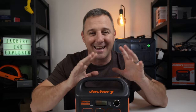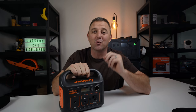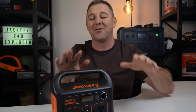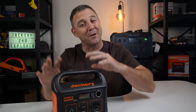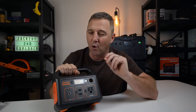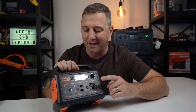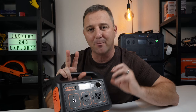Here are a few things I actually find useful. First, this power station is not too expensive — I've found it for around $200, with the highest price coming in at around $220. Check the links in the video description to find out the current price and updated features. It also performs according to its specifications; nothing makes me happier than a device that actually does what it says. When this inverter says it will sustain 200 watts continuously, it actually works. This 200-watt AC inverter will support spikes up to 400 watts but only for a very short time. It's also important to note that it only puts out 110 volts, where a typical home wall outlet gives you 120 volts — so this might matter for high-precision devices, but for most uses this is not an issue.